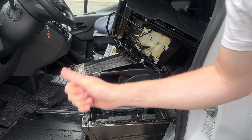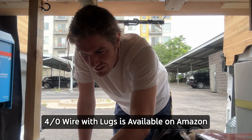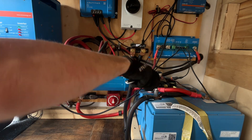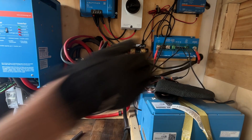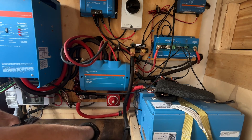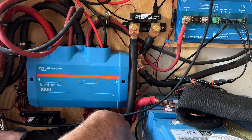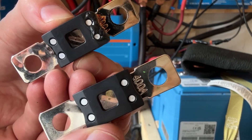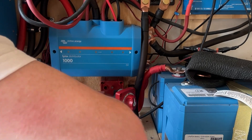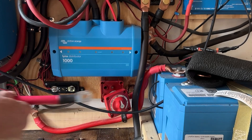Batteries off. I already ordered a prefabricated 4-AWG wire to fix the broken one. Before touching anything, I'm going to disconnect the negative terminal of our battery. That's burnt to pieces — it burnt up the plastic. We've got to take this off, replace the whole wire, and replace this fuse too. Look at this — you can see it started getting burnt up there. The new one looks clean compared to the one that got burnt up. I built all the wires in here, and when I did I thought it seemed too flimsy. The new one is obviously a lot longer, so we'll have to figure out how to make that work.